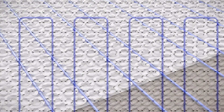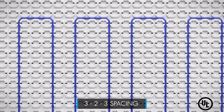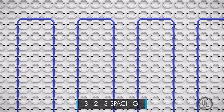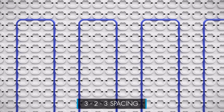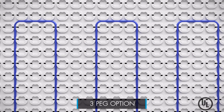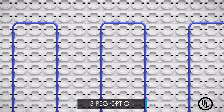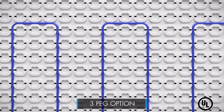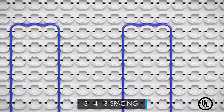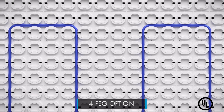There are several wire spacing options. First is the standard 3-2-3 spacing, the minimum allowed, primarily used in areas requiring a rapid heat-up time — the higher heater power will not necessarily lead to more heat output, just a faster heat up. Next is the three-peg option, considered the standard approach and works best for most projects, with enough power to heat up quickly but using less wire and being more economical. Last are the 3-4-3 and four-peg options, primarily used in areas with lower heat loss such as well-insulated homes.